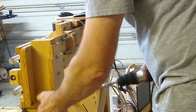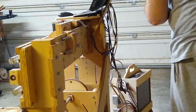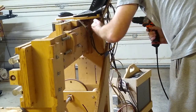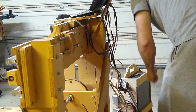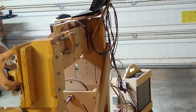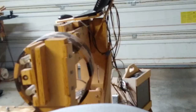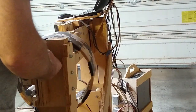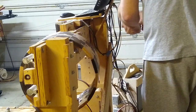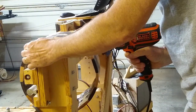Now it's time to skim the inside of the drum. To do that, we have to get the drum around what we call the gantry, even though this gantry doesn't move. There are eight bolts holding it in place — I'll take seven out, leave one attached, then lift the gantry to the side while I put the drum around it, and put those eight bolts right back in. This method does work, but if I rebuilt this machine from scratch I would probably do it a little differently.